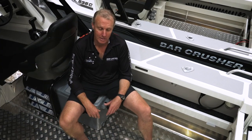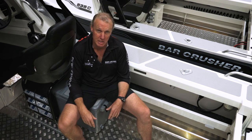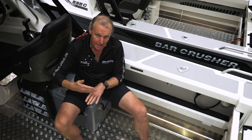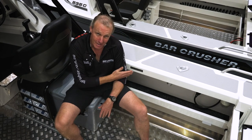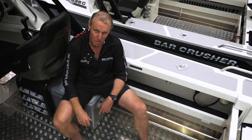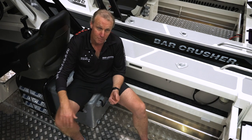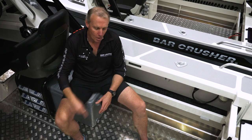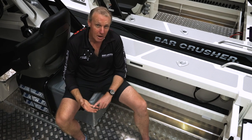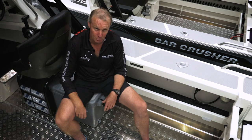The guts of a good aluminium boat is a strong subfloor framing system. In Bar Crusher we call this Rigid Deck. It's a system that involves full longitudinal stringers running from the floor down to the bottom plate of the boat — in this model there are six running full length, with cross frames between them. That subfloor system is fully boxed and triangulated. When we drop the tread plate floor in on top and weld it in, the whole thing's triangulated, nothing moves, it's rigid as you like. When you're out in chop and swell, it's very important that your boat doesn't continually flex like an aluminium can because it will break.